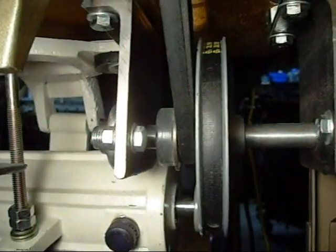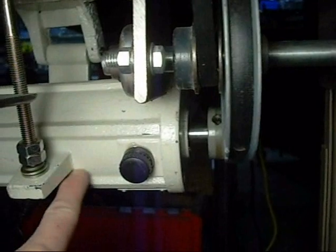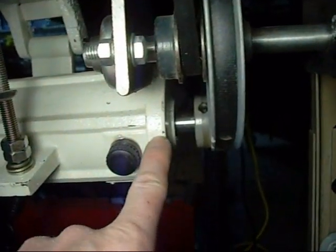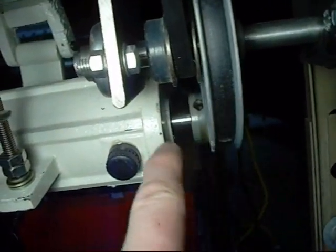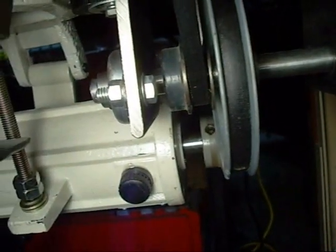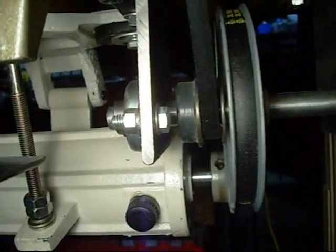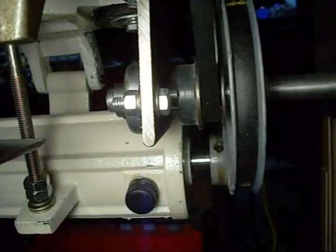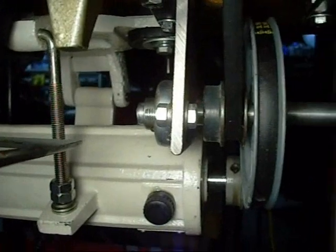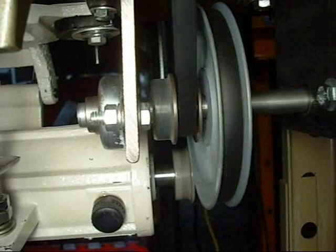This particular machine features a reduction drive unit, as well as a servo motor drive, which is a DC motor with a speed controller. With this particular arrangement, the motor actually drives this large pulley here, and then a smaller pulley actually drives the sewing machine head. Judging by the ratio of the diameters of the pulleys here, it's about a 3 to 1 reduction, which effectively triples the torque of the motor and cuts the top speed down to a third of its normal speed. So if I step on the pedal, you'll see these guys rotate there.